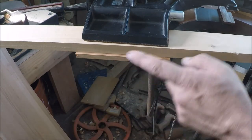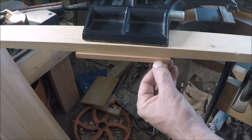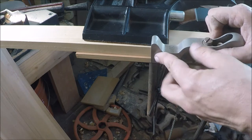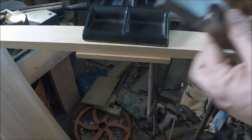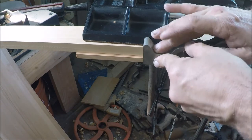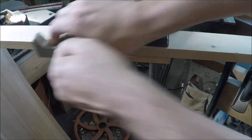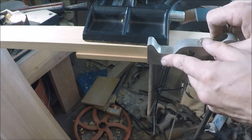So what I've done — I've got my part here and I'm using this board. It's nice and straight as a fence. I've got it lined up right on my groove, and then we've got the other markers down here. We're going to take this plane and hold it against this fence. I'm going to have to take a little bit deeper than that — got to get it adjusted the first couple of goes. Starting to cut a little now. Let's go a little bit heavier than that. Pine cuts easy.